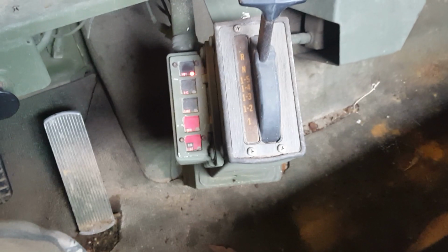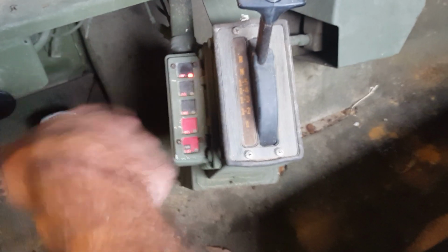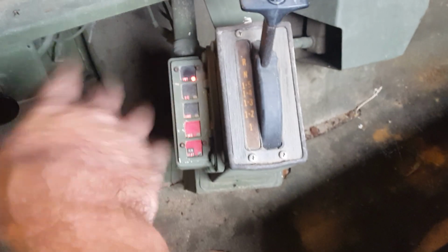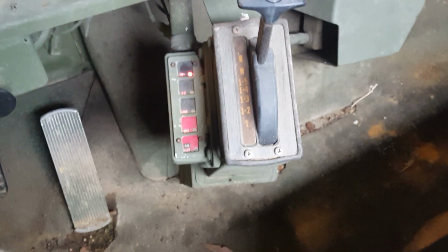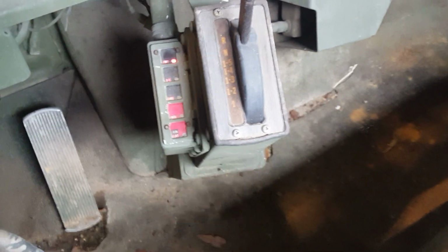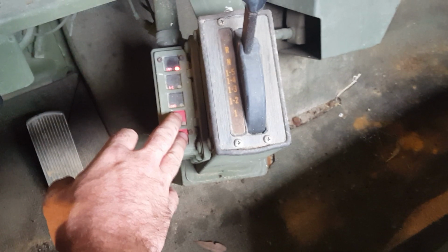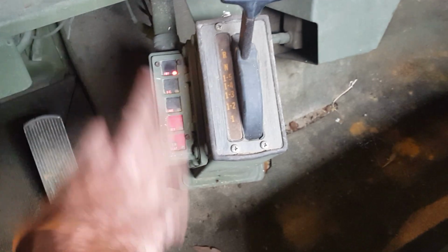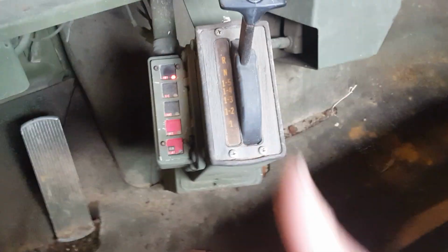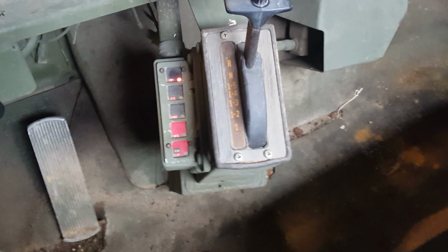So, you know, a lot of people say, well, once all the lights start flashing, that's it, your controller is bad or you've got another problem. And that's not necessarily true. Just a lot of people don't know that you can hold the two emergency buttons down and get it to basically do a reset. Resets all the pressures in the tires to the same at the lowest setting, and then you can go up from there.